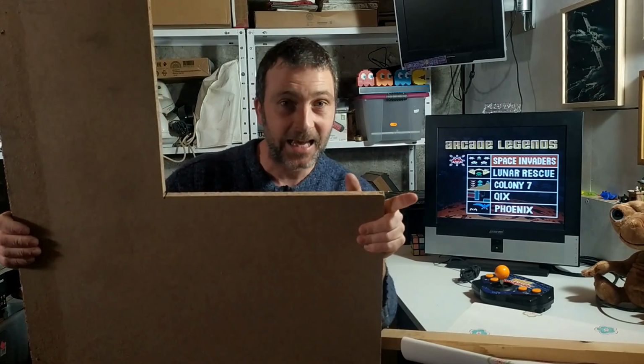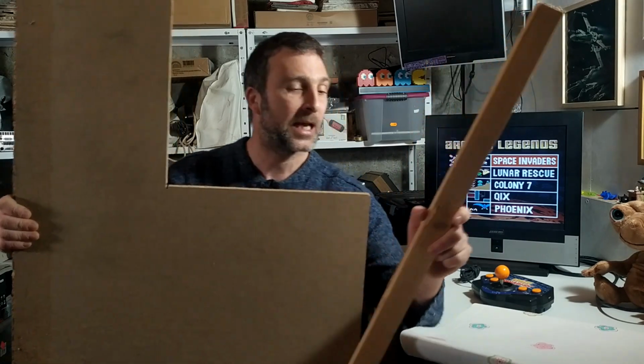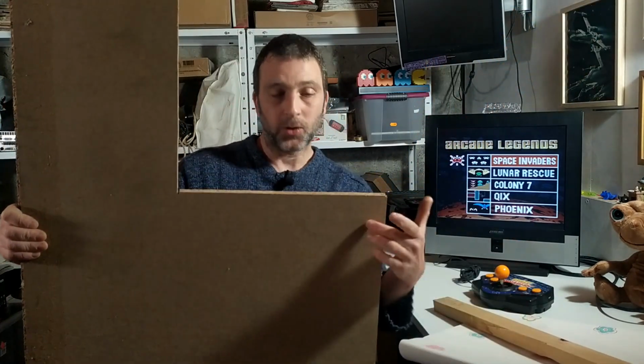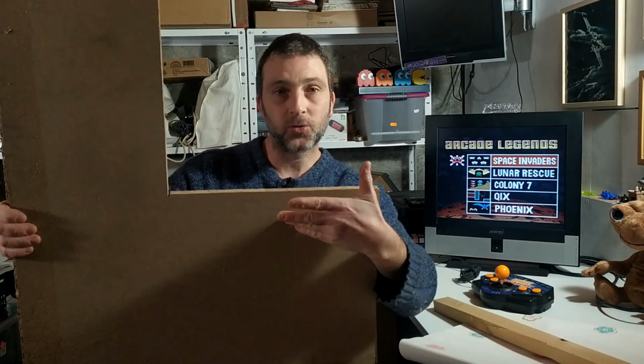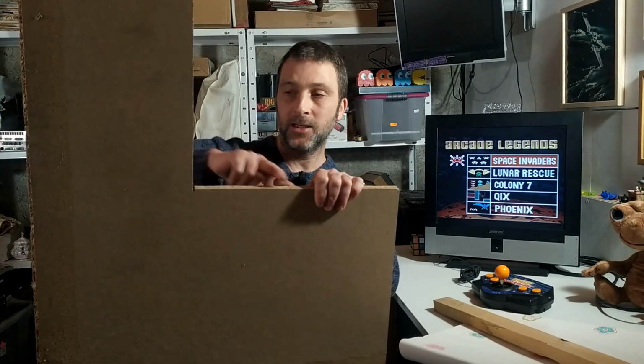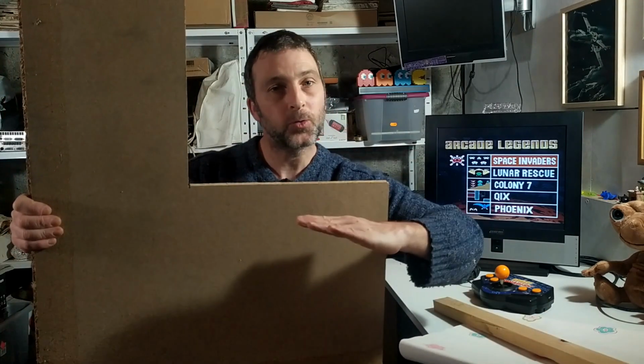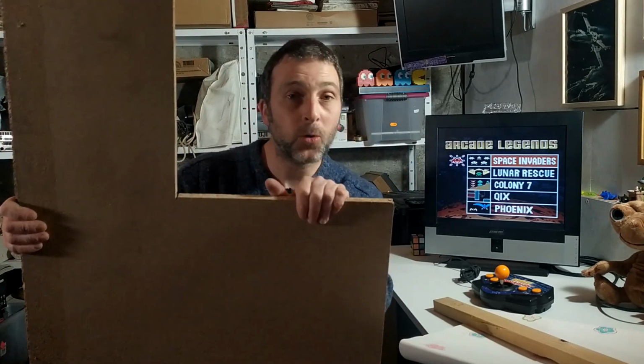Now, in order to put everything together afterwards, because the rest of the parts that were needed were more or less square pieces of MDF, I used lats. Now, this isn't one of the original lats. It's much, much bigger. The lats I used originally were 1 inch by 1 inch, or 25mm by 25mm. Using the plans again, I could mark on my pieces exactly where the lats should go and draw them in. Then I could cut the lats and screw them to this board. And it served a double purpose. It strengthened the piece and a half that had been glued on, because the lat transcended both pieces and was screwed in. And not only that, but it provided somewhere where I could screw in the other pieces that I would put on top. Now, I hope that makes sense.